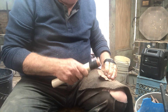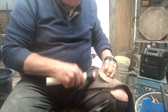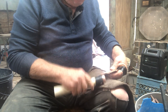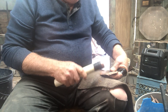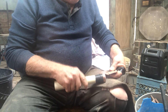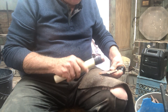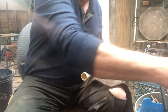I'm barely tapping because I'm right on the point and I don't want to run the flakes all the way across and overshoot and lose some of my width. You hit down to bring the edge up. I'm going to bring this edge up so when I turn it over it's going to be low. It's up right now — it's going to give me a low edge.